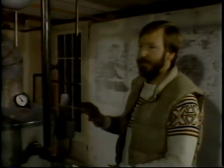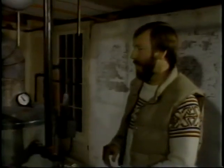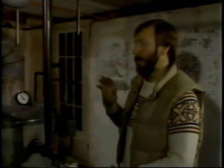Why do you suppose I'm wasting so much heat up the chimney? Well, it could be the age and condition of the boiler. That certainly is one thing. You can see that it's not in good shape. However, it hasn't been cleaned in over 1.5 years, and these should be cleaned at least once a year. So you're not going to recommend right away that I toss this old friend out? Never, never. It's got to be cleaned and serviced first. There's a lot of soot that's built up in there, and the nozzle could be clogged. There are normal things that need to be changed that can significantly affect the efficiency, and you're at about 70 or under 70% right now. Not so good. You want to be up around 80%.